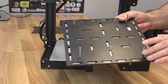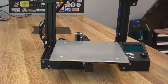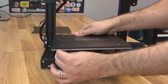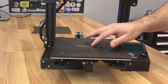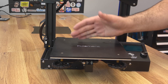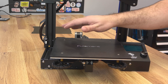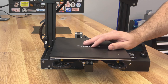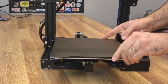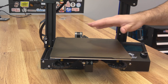Their intended install gives you some extra hardware — slightly longer screws that thread into your Fullabed from the top, which go down through your stock build plate. Your stock springs go back on those screws, and then you reattach your bed leveling wheel. After installation, you will have to re-level the bed. I actually raised the Z end stop a bit because it is 5 millimeters taller, so you will lose a little Z — but it's only 5 millimeters. They also offer a couple of threaded holes if you'd like to rework your wire restraint, which on an Ender 3 is probably not a bad idea. Your spring steel sheet goes right on top, and they even have alignment pins — not every company thinks of that, but they're a lot handier than you'd imagine.